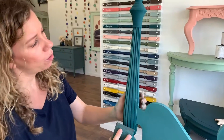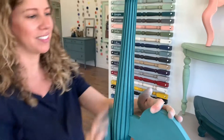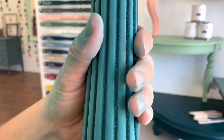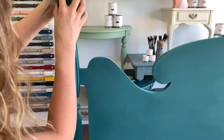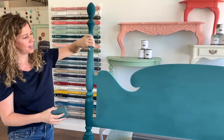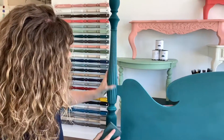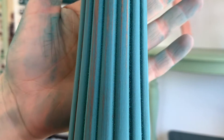So I'm going to distress this area here just the same as I distressed the whole flat — just going over it overall with my sanding block. And as you can see, doing that doesn't get into this recess here, which generally your distressing wouldn't happen in the recess anyways. But I'm just going to turn my sanding block on a slight angle to make sure that I get right in there. I'm just going to do a once up and down in all these areas. Once I've got overall, I'm going to do a little bit more distressing because I think a little bit more of that original finish should come through in this area. And you can see right there, very quickly, we got some beautiful, beautiful finish coming through.